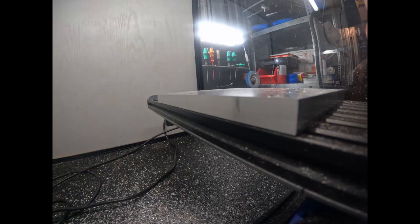So, yeah. To fix this, I switched to the 6mm end mill that I had to use anyway, and finished the cut like that. I didn't take any video of that, though. So, here are some pictures of the surface finish after that. The next thing was a lot more holes, all the holes for the M5 threads, and the 6mm alignment pins. I didn't take much video of that, so let's see what we have.